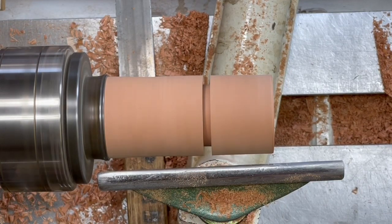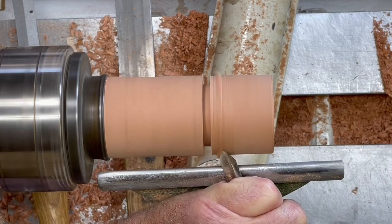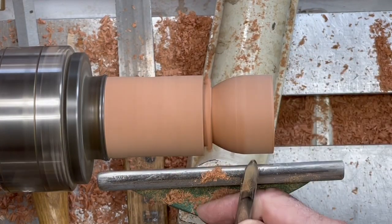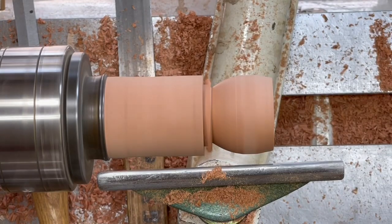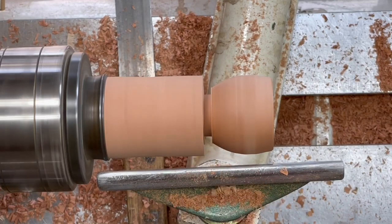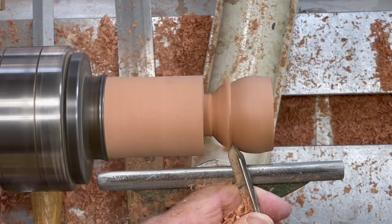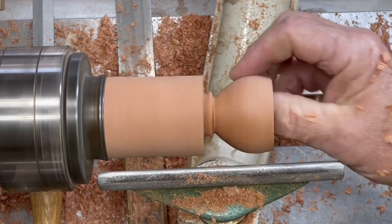The handle will be out here. I'll do that in a series of steps too — I don't want to do it now because I still have to form this upper portion, this cup. Don't go too thin there. This is a sharp edge. I generally like to use the long point of the skew to just knock that off. Bring this down some more, knowing that I have almost a quarter of an inch between here and there.